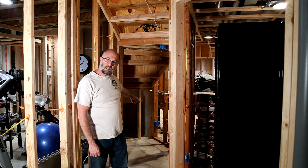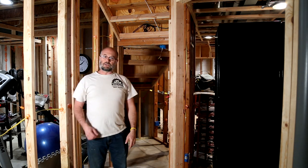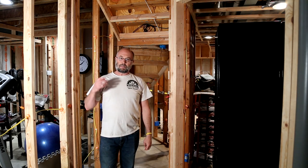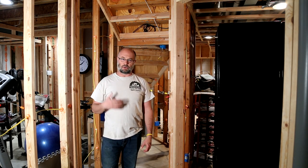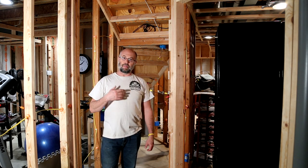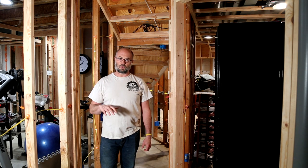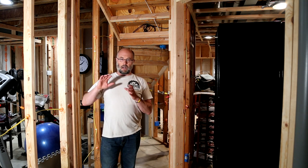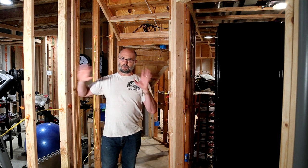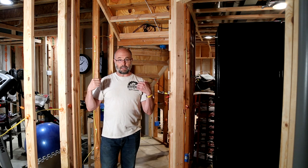Fire blocking underneath the section that we're not going to have access to, and that is blocked off of the wall. So what is left to be done is I have to get stuff done in the rest of the basement, fire blocking, etc., so I can get inspected. We'll then be ready in here to install vapor barrier, because this is going to be not only kept cool but a slightly higher humidity than the rest of the basement. After the vapor barrier will be insulation in all these walls, the ceiling, drywall inside here.